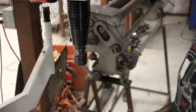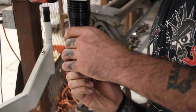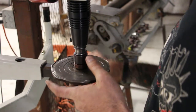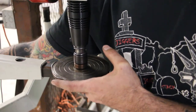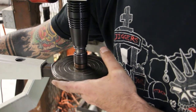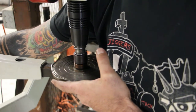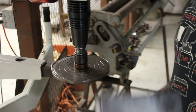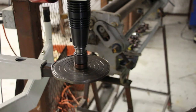I have the piece fastened and ready to go. I'll be using an R4 reverse curve die. A little tip: depending on the thickness of the form that you make, you may have to use another plate underneath your piece just to fill the gaps so that the machine hits properly. It's a lot easier anyway than adjusting the machine. I have mine set up with a couple of extra pieces — I can clamp onto these, put them right in between to take up that extra space.